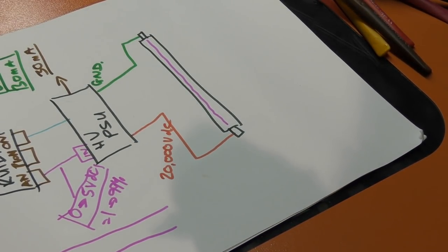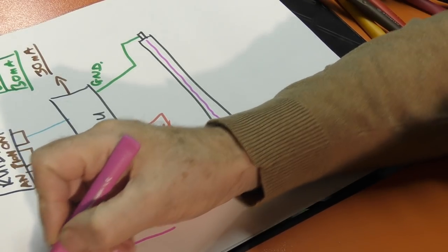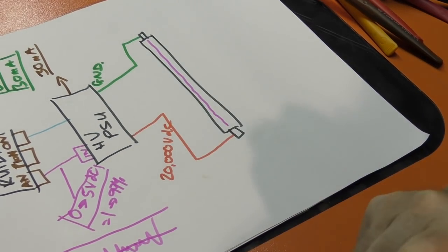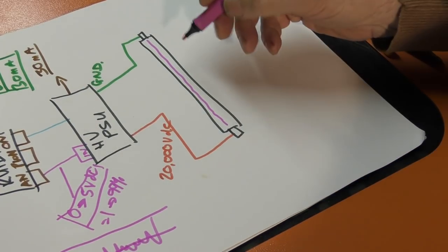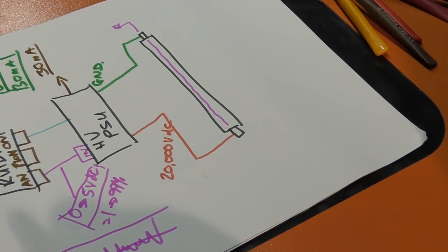It's very likely that our 5-volt signal here, which is right next to this big RF generator, could not look like that. It may well look like this. And if the input signal to here looks like this, then the output signal from here, your watts, is going to look like that as well. We want the most stable output that we can get.